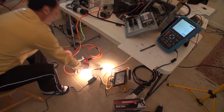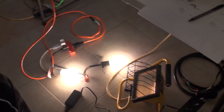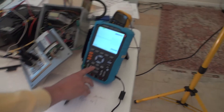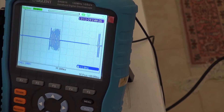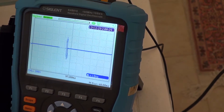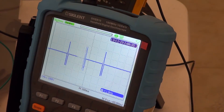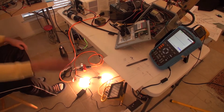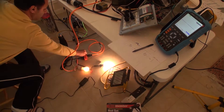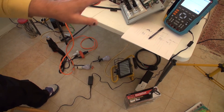I turned on 75 watts — as you see, it still can't make a dent. This is just three inverters generating this much excess power, so imagine if it were 30. I'm going to add another light bulb — 150 watts total now. You can see how often the SCR is getting triggered. If I turn off the lights, the SCR triggers more. If I put more load on, the SCR doesn't come on at all. Now I'm putting on a 750-watt load — as you can see, no more load is being dumped. Everything goes to the real load.